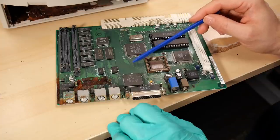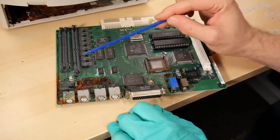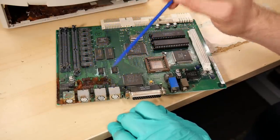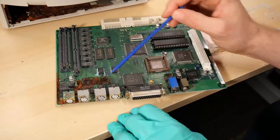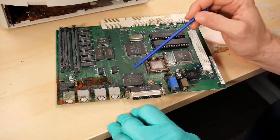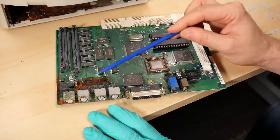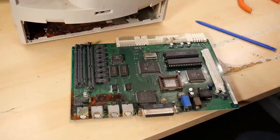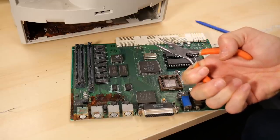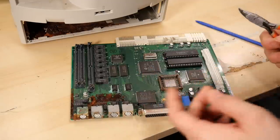I'm going to say my best chance to try to get this board working is to remove these capacitors. And then I'm going to do the trick that I did on the Macintosh Classic board — I'm going to soak all of this rusty part in WD-40, which people had mentioned converts these lithium salts into something that neutralizes them. Maybe I don't remember the exact chemical reaction, but it seemed to have a beneficial effect that with a little scraping released all of these rusty parts from the board. So I will take a couple pictures of the board here, just so I can remember the exact layout of where the capacitors were. For removal of the caps, I'm going to be using the twist method. And this seems to drive some people absolutely crazy, but it's what I'm going to do — I'm sorry if you don't like it. You're definitely free to change the caps on your boards however you like.